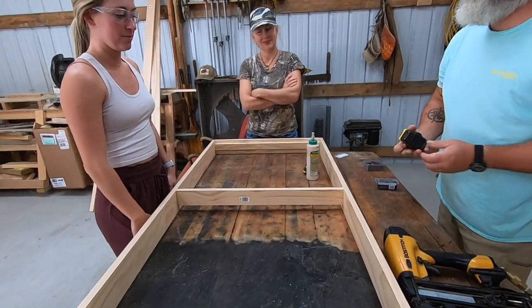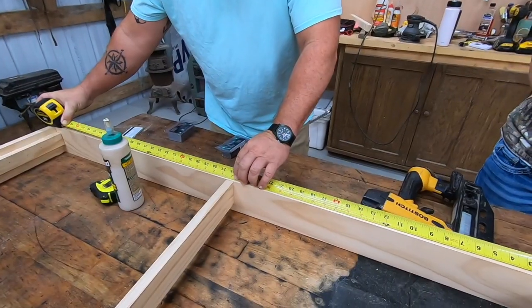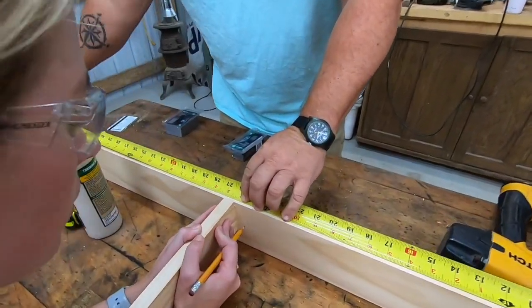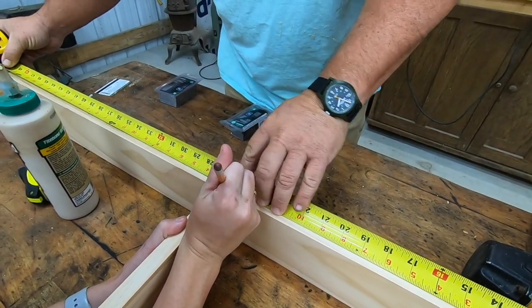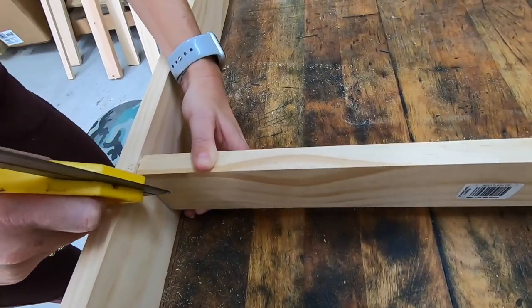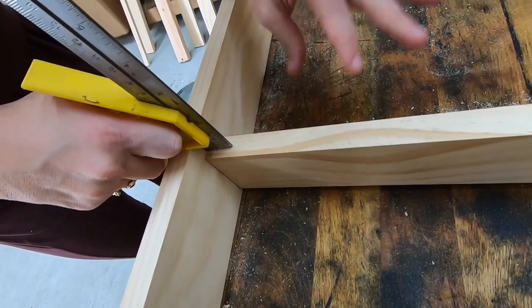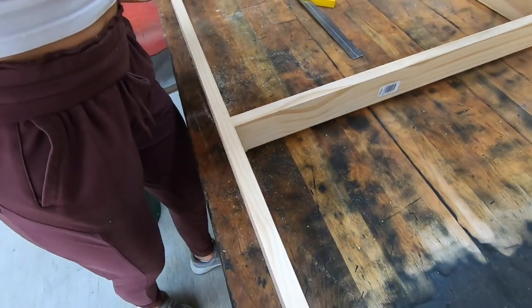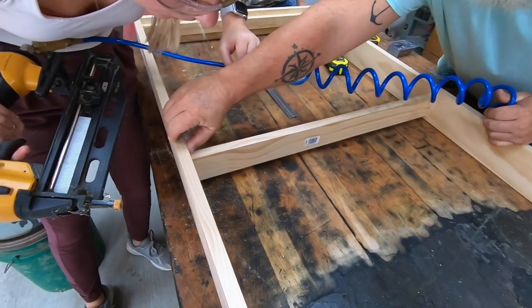How long is this? Fifty-two. This is fifty-two and a half, so mark twenty-six here and twenty-six over there. Do your little mark up here. Okay, there's the middle, there's three-quarters. All right, go ahead and just one nail, just one nail in case she needs to pivot it because she may not have it up and down square.